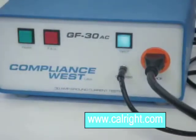When you have adjusted the cal point until both lights are lit, the adjustment to compensate for the resistance of the leads is complete. Release the blue button, remove the connector, and disconnect the leads from the resistor on the rear panel. The GF30AC is now ready for production line testing.